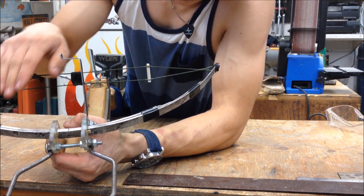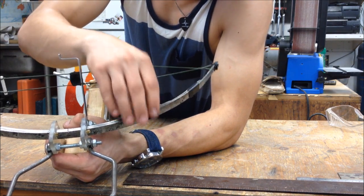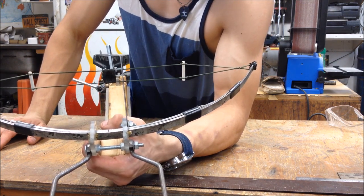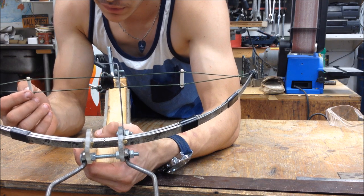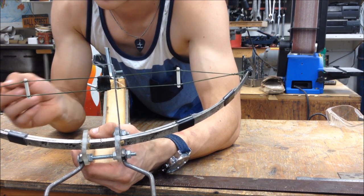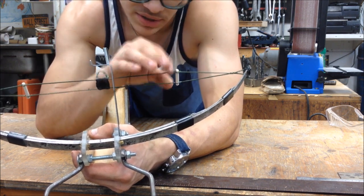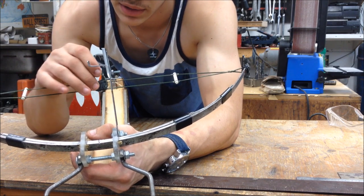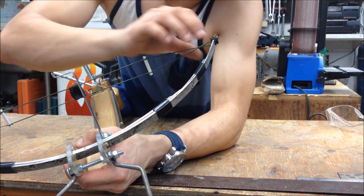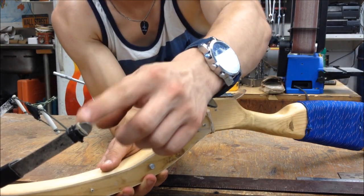The bow itself, you can see, is made from stacked — stacked this way — and it is flat throughout. It's non-tapered, but it's tapered in thickness, technically, because it's stacked together. And there are four strips of swede saw steel from a swede saw that I had. I used it in a lot of my other crossbows. The string itself was fun to make. It was my first actual amateur crossbow string. I made it completely myself out of some knock-off spider wire, and I just wound 20 strands of that on little pegs that I turned on a makeshift lathe from a drill. These are to keep the string spaced out. The pouch itself is made from hockey tape, and this back here is made from some thicker, even more knock-off spider wire, which is then wrapped with the lesser spider wire. Same with the end loops. The end loops also have leather and electrical tape in place to keep the string from getting cut up.